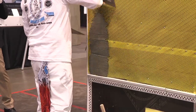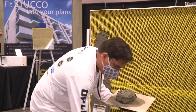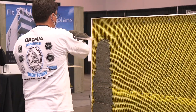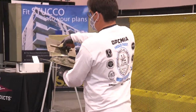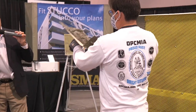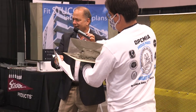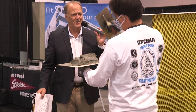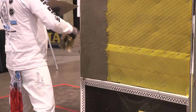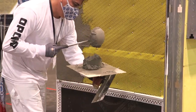What Pablo is doing is he's taking the mud from the front of the hawk. Did you see how he takes the mud from the hawk at the front? You'd think to take it from the back — that's how you start when you're first becoming a plasterer. But when you go to turn it back on yourself, it goes all right down on yourself. The reason to take it from the front of the hawk is, one, it's ergonomically better on your body — you're not having to lift it over the mud. You're just going right to the wall.